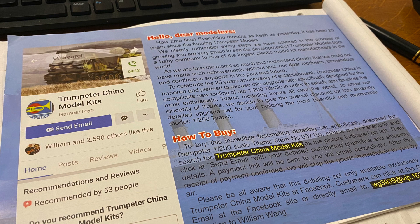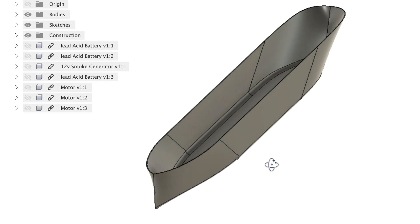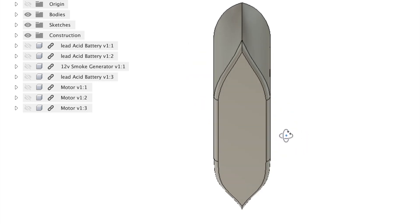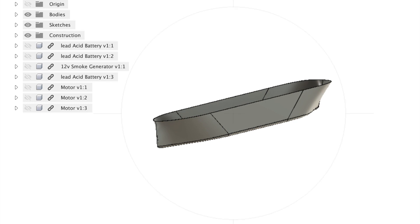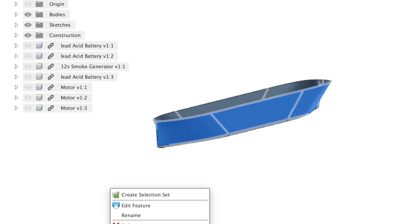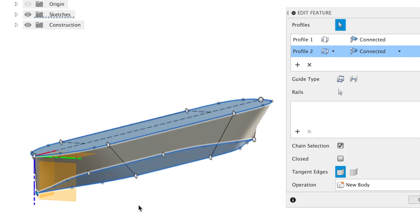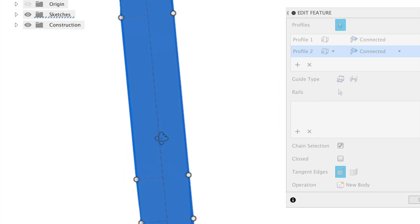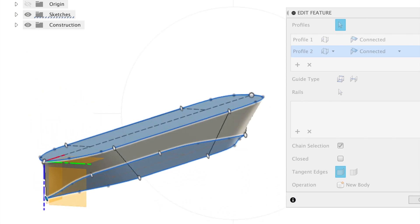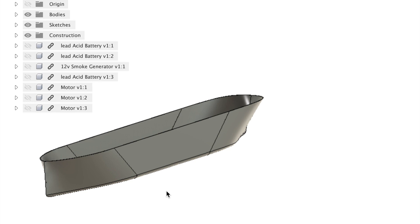For anyone who's made a model boat before, you'll know that space is at an absolute premium in a project like this. Firstly, just because inherently you don't have much space in a model boat. But a much more important reason is because anything heavy absolutely has to go as far down in the hull as possible. By having weights lower down in the hull, you'll lower the centre of gravity of the ship, and therefore you'll have a significantly more stable craft than you otherwise would. That goes a long way to defining how you lay out your components.